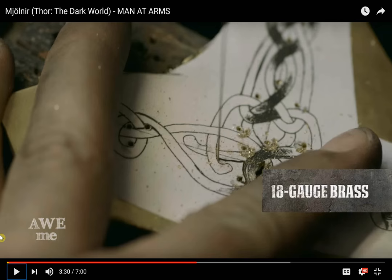Brazing is different. If I were to braze these two together, I set them on top of each other however I want them, and then you take a solder, just like an electrical solder. Similar concept. You don't actually use lead, and here they're going to use silver, something that melts at a lower temperature than these. Put it near the edge, heat it up, and then because of surface energy, it wants to go in to reduce its surface energy. So it actually goes in and sucks into there.